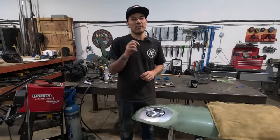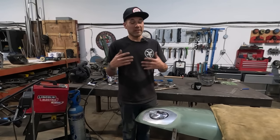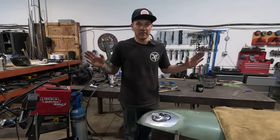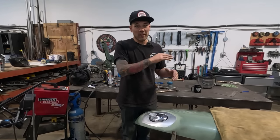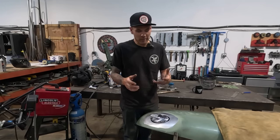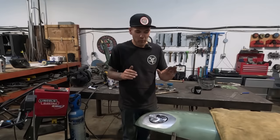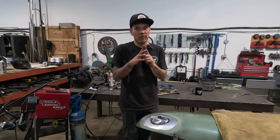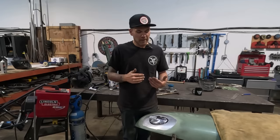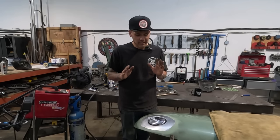I would not recommend drilling those holes first because then the flange can evenly distribute its stretch along something that is the same strength the entire way instead of being weakened by the holes. It also ended up splitting on me, so I was kind of fighting that a little bit through the whole process, because anywhere where it split, it's like a major weak spot and it wanted to kink the metal. So don't do what I did there.